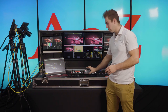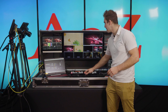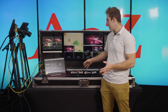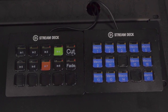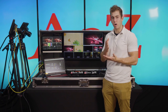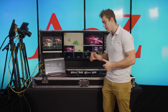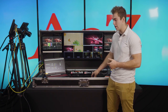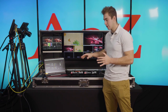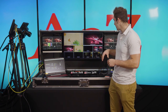Over here I have Companion loaded up with our two Stream Decks. This one is really just letting me switch between different sources. And then over on my other Stream Deck, it's actually just controlling the ATEM Mini Pro ISO. The way I have it wired is I have a program feed, an aux feed, and cameras seven and eight all being routed into the ATEM Mini Pro ISO. This is because the ISO can record all four of those sources individually. So I'm handling all of my ISO records as well as a program record in the ATEM Mini Pro ISO. Then I have my backup program record in the HyperDeck as well — always love my backups. The perk of using the aux being sent into the ATEM Mini Pro ISO is I can route the output of the ISO back into the switcher and basically use it as a sub-switch.